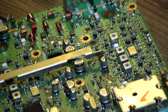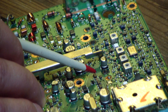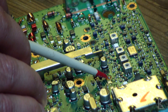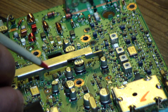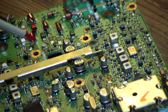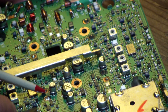Flipping the board over and looking at the other side where these pins come through — the pins come through the board and are engaged with pads on this side. Over here on the VHF side, the pin comes through and it's got a little ball of solder on it, but there's almost none making to the copper on this side. This didn't get soldered well at all at the factory — this might be our main problem right here. There's another one on the UHF side that's just a little ball of solder on the pin that didn't really make out to the solder pad, and these barely have some coverage. That one looks like it's barely making contact if at all.